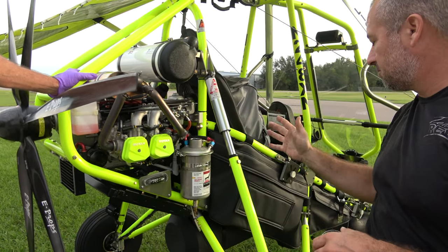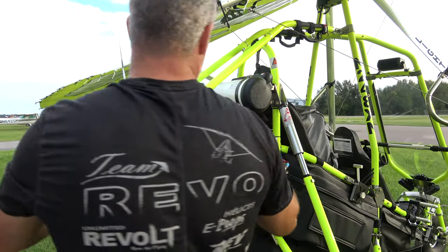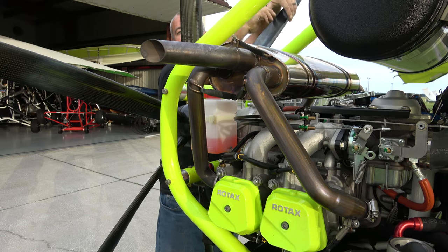What we've done is we've warmed up the engine, and you don't wanna do this with cold oil. It's very important that we burp the engine. So if you come over here and listen and watch, I'm not turning the prop quickly, but you will hear it burp.